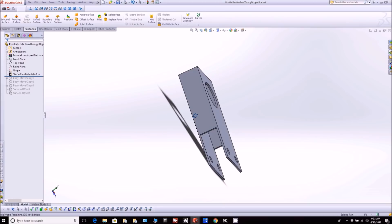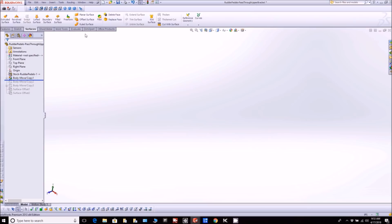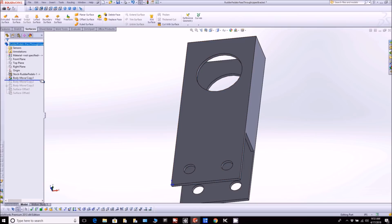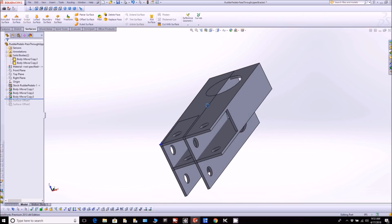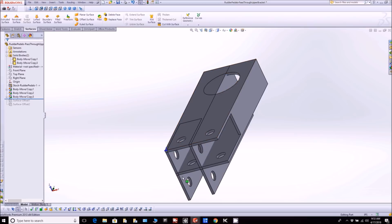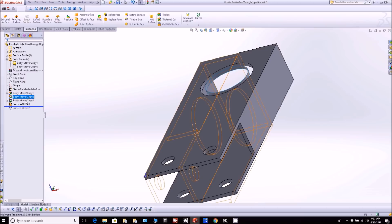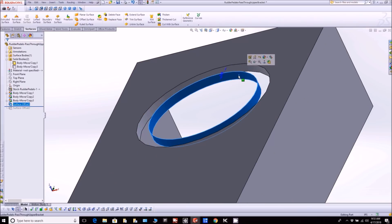The top piece is what we'll focus on first. I'm actually going to be using a bit of 4130 rectangle tube which is one and a half inches wide by three quarters of an inch high. The first thing I've done in CAD is orient this so it's lined up with how the machine's lined up. I'm creating another copy of the same part and positioning it so I can do the side cuts, so I've got one for the face cuts and one for the side cuts. I'm creating an offset surface for where that big hole is, offsetting at 3/32 of an inch, which is basically half of 3/16ths - the width of the end mill I use to cut it.